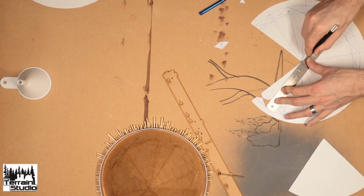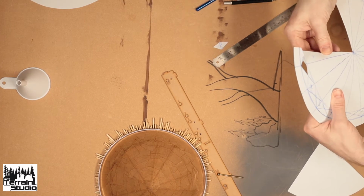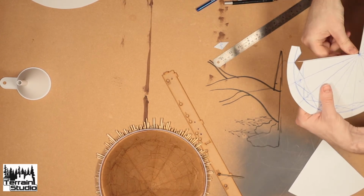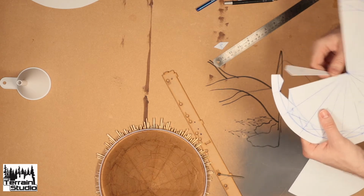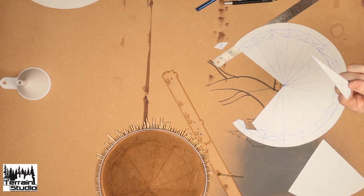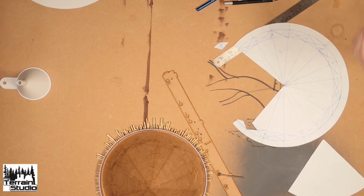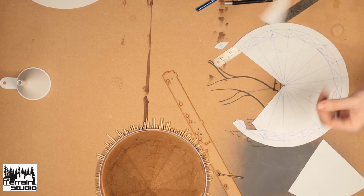Just kind of a school of thought for me personally, bend, snap, is that the thickness for me is if it's one mil, four cuts. If it's half a mil, two cuts, scoring cut, and then one, I can bend it. And then I just basically use two cuts per half mil. So that's kind of my rule of thumb.